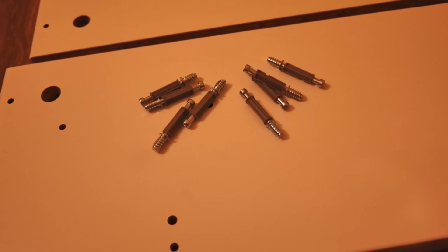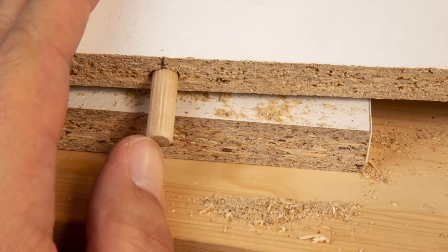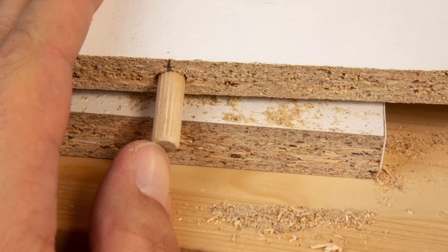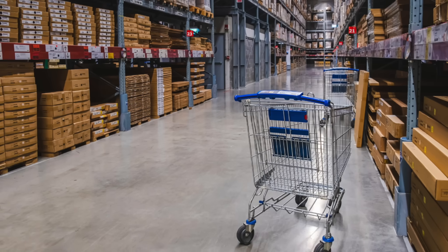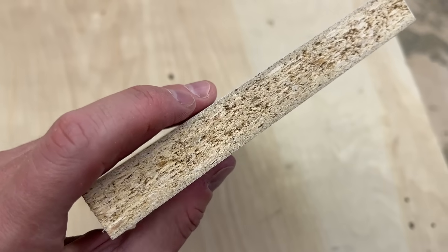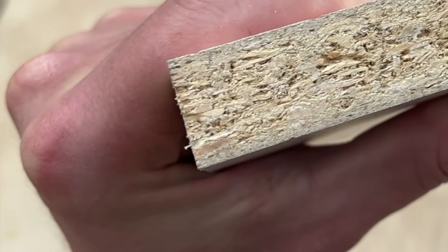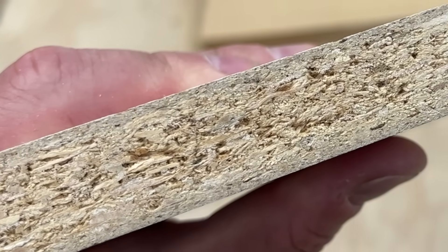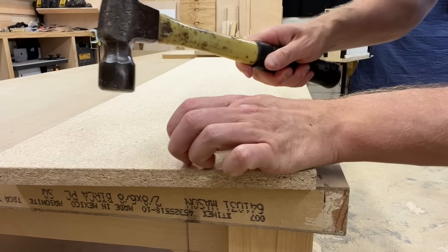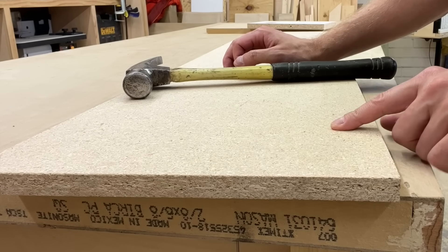They overcome the material weaknesses by using proprietary fasteners that lock the boards together with a bit more compression. In some cases they use dowels and glue, which hold about as well as screws. This lets them design and produce cheap flat-pack products easily assembled by homeowners with limited tools and experience. One unseen advantage of particle board is that it actually has more surface density than wood or plywood. If you look at the edge, you'll see that it's layered. The core fill is a bit looser with more visible air gaps, but near the surfaces the wood fiber is quite compact, making it more impact resistant than most solid wood products.